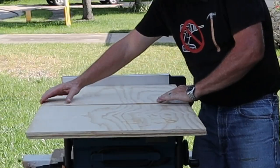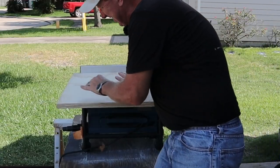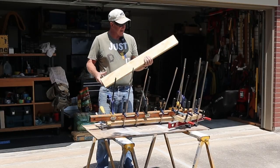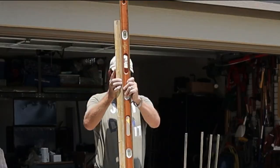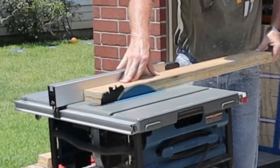I'll use the paintbrush method again to spread glue. I'm gonna take one of my three-inch throat plate pieces as a spacer, put it in here against the edge, put some weights on here, and let this sit for a while. They set up all night in the clamps. This one's out of the clamp — nice and straight, beautiful, no daylight. Right now I'm just gonna run it through the table saw on each side to clean the edges and the glue, get them good and straight and all even. I'm only shaving off just a smidgen to get it smooth.